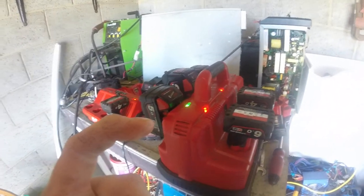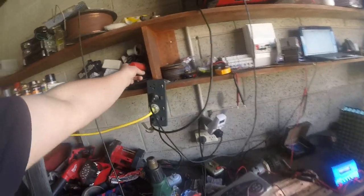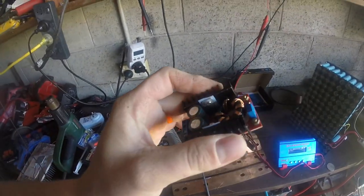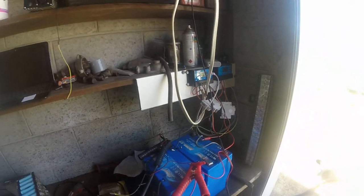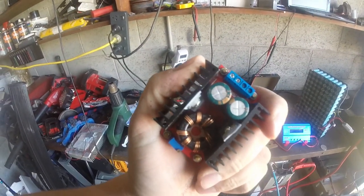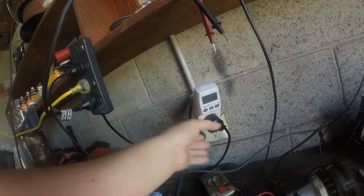Behind here I've still got my big bank of batteries that I'm going to have to do something with. My thought is to use a step-up converter — two of them actually. If I set one to about 16.5–17 volts, I can charge two of the cells in that bank off this setup, using the power takeoff — the outputs that kick in when the batteries get full — to divert power across and charge those batteries. Then use the second step-up converter to charge three batteries, so one converter charges two cells and one charges three, bringing that pack up to 25–26 volts. That way the pack always gets topped up and I'm not sitting here full of power with nowhere to put it.